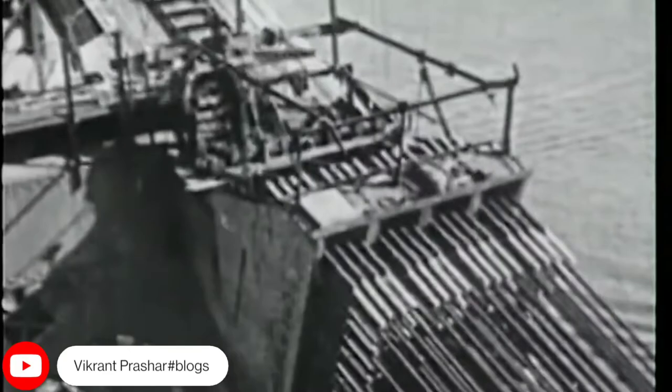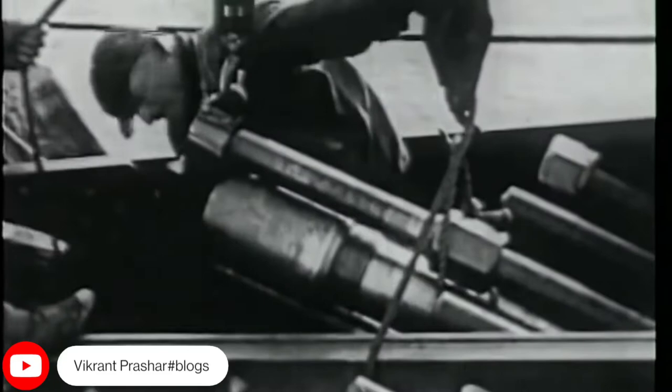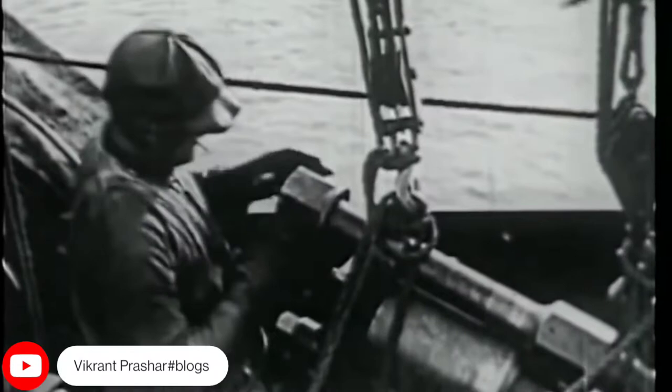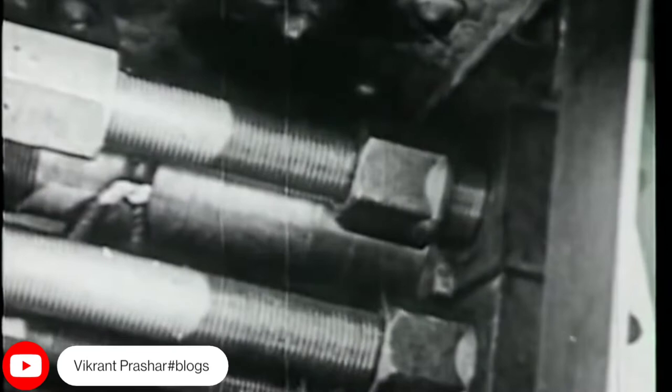The cables to the extremity of the top cord were arranged in 8 rows of 16, 128 in all. Those are the hydraulic jacks. The sockets were picked up with two 9-foot, 3-inch diameter bolts, passing into a saddle over the 11-inch diameter pin in the link, and then continuing to house a hydraulic jack. And if they wanted to ease the nuts for running them out, as was done in the lowering operations, the hydraulic pressure would be applied. That just eased the weight off the nuts, and it was able to unscrew them by hand.